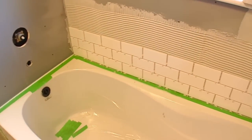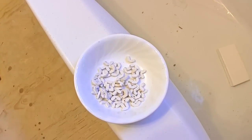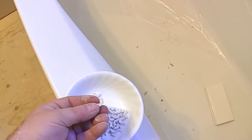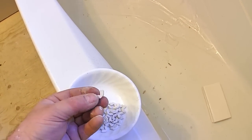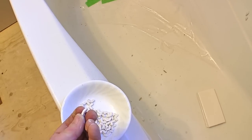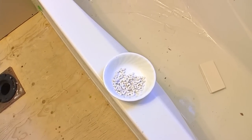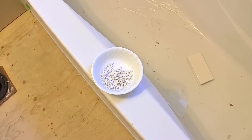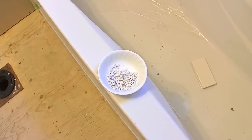It's coming along well, but I'm running out of spacers, so I've cut the ones I had in half — they still fit in there no problem. Some people think the plus shape means they fit right in the corner of the tile and you leave them in there — that's simply not the case. They're plus shape so you can slip them in from any direction, including vertically, to increase the gap. With tiles you're always going to have to cheat, so locking tiles in position like that won't work for you, and it limits how much grout you can get in there. Not a good idea.